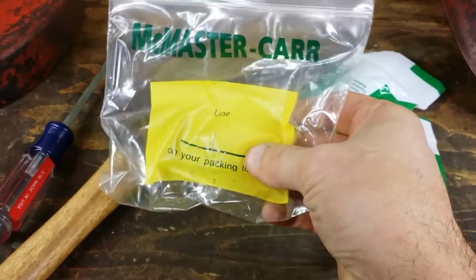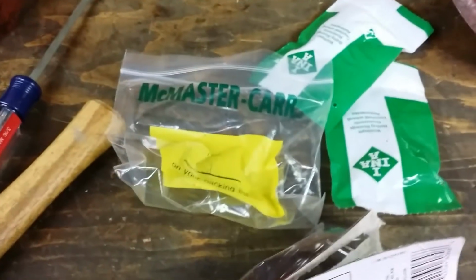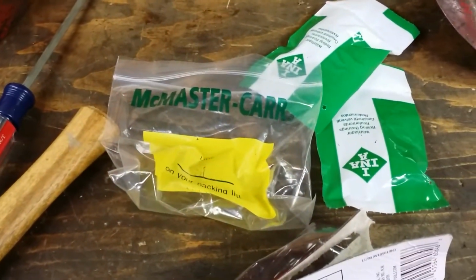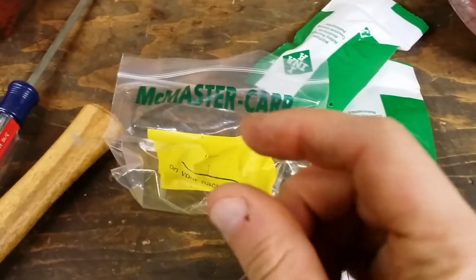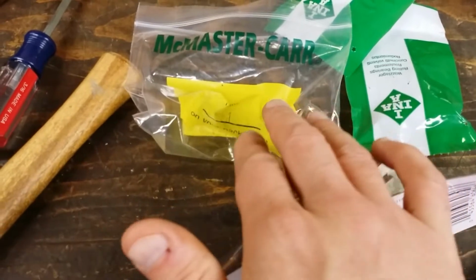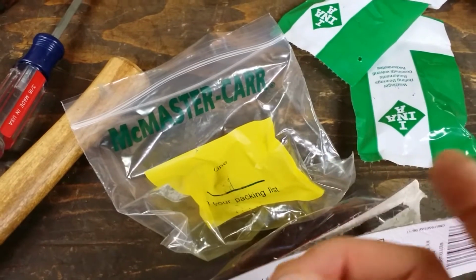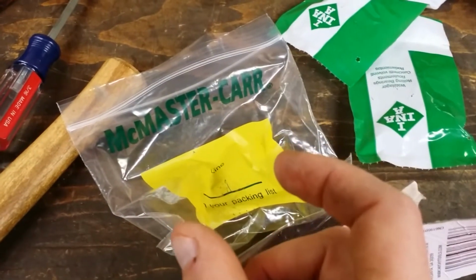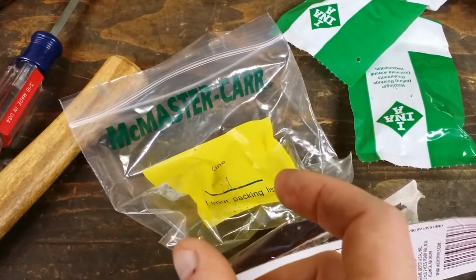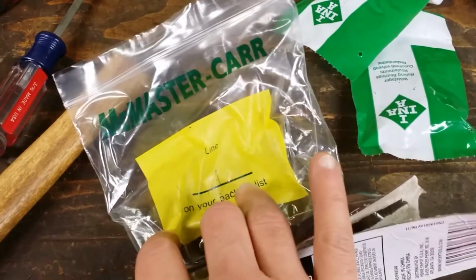The bushings are a little interesting. They sell a couple sizes of bushings. Basically what you need is a 1-inch inner diameter for the axle shaft and 1 1/8 outer diameter in order to press fit into the axle tube on the tractor. The overall length is supposed to be 1.5 inches, but nobody that I have been able to find actually sells a 1.5 inch wide bushing. So you have to do one of two things.